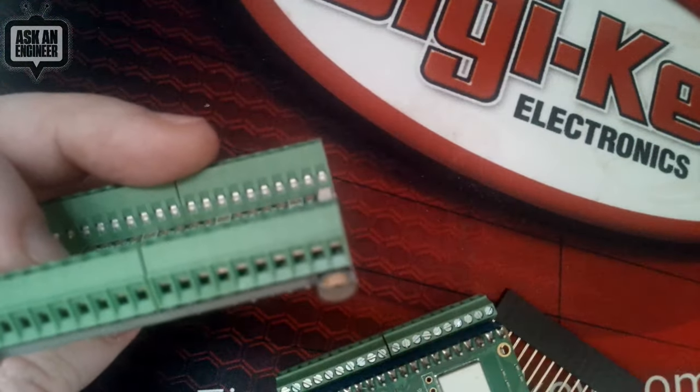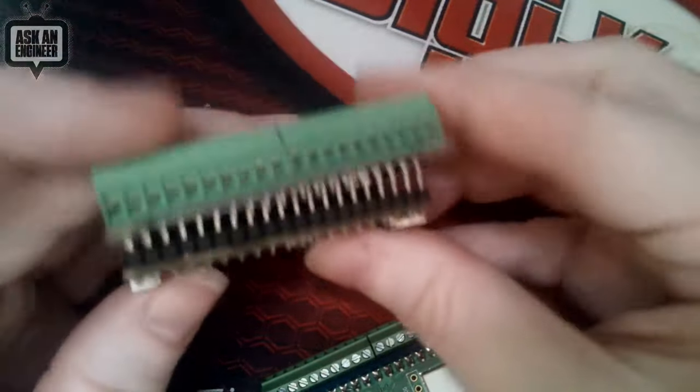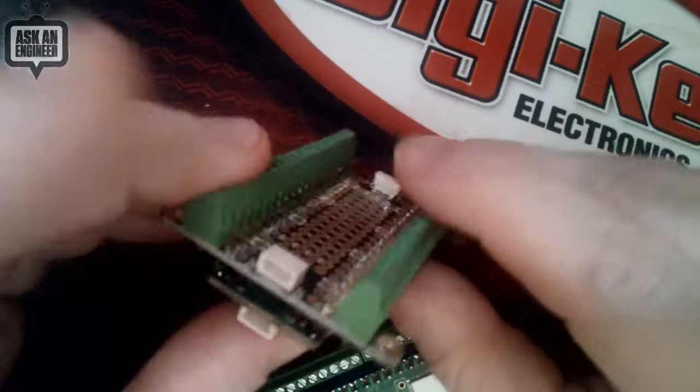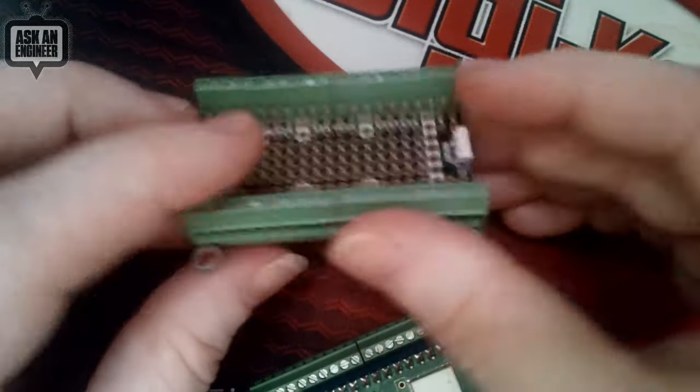Another thing is if you soldered the pins on your Pico upside down, as it were, you could plug it in from the bottom and solder it to the top for a very slim setup. This is a Pico Bell, but the same idea.